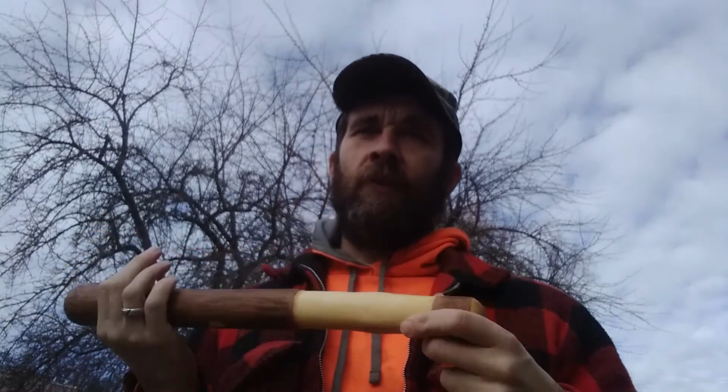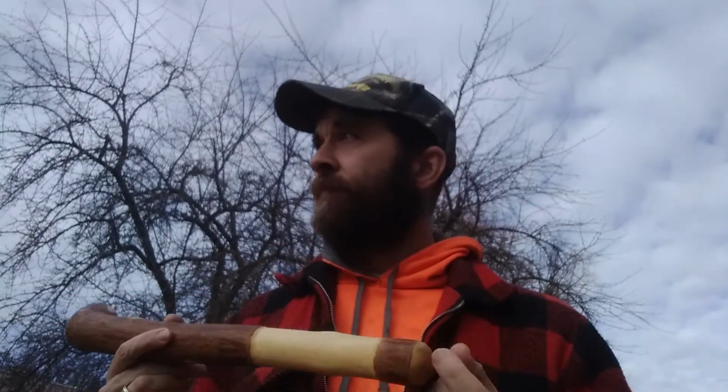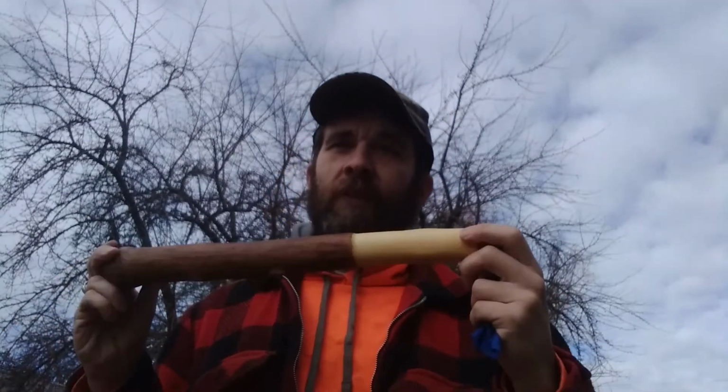First, I'm gonna buff it with steel wool, and I might scuff with 220 grit sandpaper, put some more linseed oil on there, let it soak in for 10-15 minutes, whatever, and then I'm gonna paste wax it after that. It's always good to refresh your coats, especially that chair hasn't had a coat of oil on it for about 5 years. So I'm gonna go to the paste wax next. Just a simple Minwax paste wax.